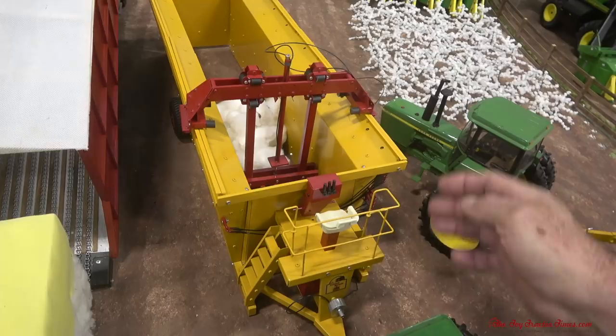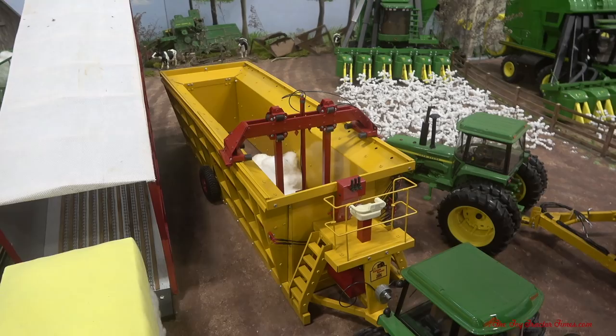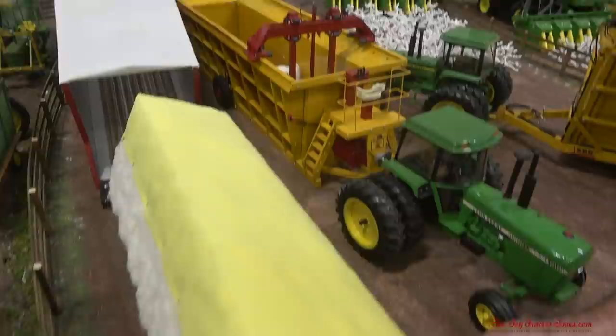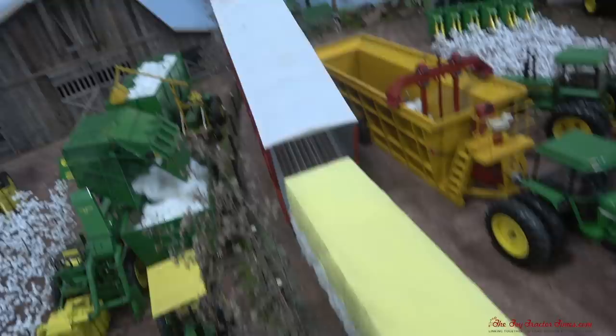The module builder ran on a track down each side — all made out of steel — and it raised up and down to pack the cotton. A man operated it; it had its own hydraulic system and the pump was actually operated off the PTO off the tractor. The module builder didn't have a bottom to it, so when it was full and all compacted, the rear end would open up. The hydraulic wheels would raise the whole system up and you would pull out from under it, leaving a bale. You would cover it with a tarp and you could store this in the field.